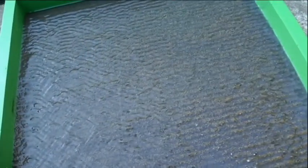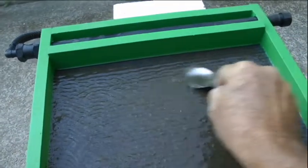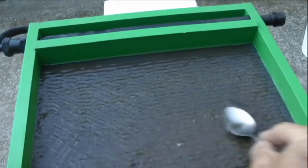What this is doing is getting rid of all of the gangue material out of the sulphides and just concentrating the sulphides down. I'll probably run this twice before I roast the concentrates — it's just about concentrating it all out so that you're not just roasting gangue material.